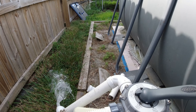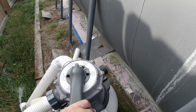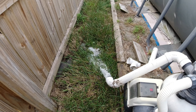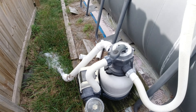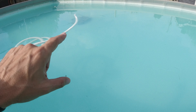When I'm done backwashing I rinse, and I do that for probably a couple minutes on each cycle — maybe not as long on the rinse. I still run my vacuum. You can see my water is not real clear, so I've still got some work to do.